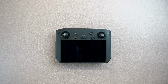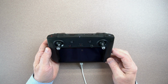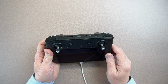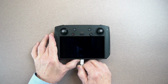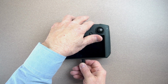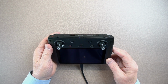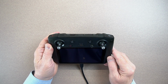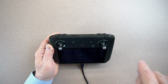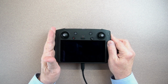I took a standard 5-volt USB charger, connected it up to the device, and I found that in fact it does charge, and you can see the strobing lights there indicating that it's a little less than 50% charge and it's working its way up to a full charge. Then I plugged in the charger that came with the unit just to see if there was any difference, and it turns out initially it looks exactly the same, where you can see it's strobing slowly, but watch what happens. It makes an adjustment because it knows it's got a high performance charger connected up to it. You can see the strobes are twice as fast. It's drinking electrons from that charger a lot faster than it would from a standard charger, which means this is going to charge incredibly quick using the charger that came with the unit.